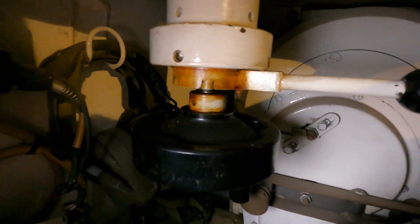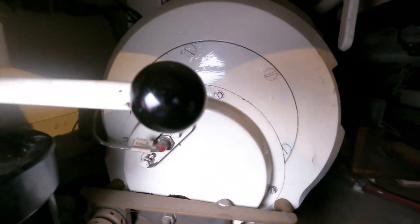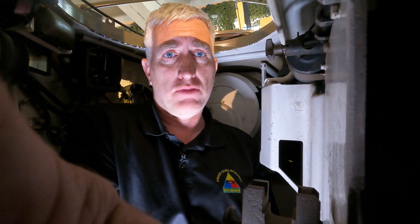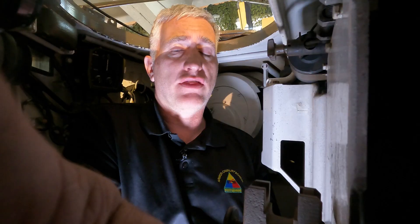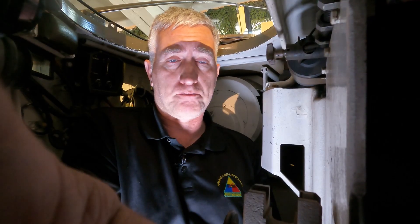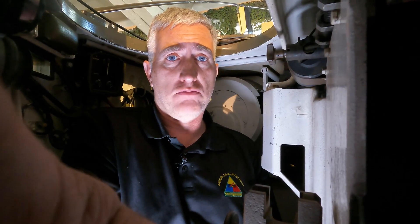The revolver over my shoulder is the same as the one on the commander's side, reversed. That leads to another problem with the stabilizer: because you're stabilizing an entire top turret, the thing needs to be well balanced. But you keep firing rounds out of the extreme far end of the bustle — it's the old force multiplied by distance thing. The weight of the 12 rounds of ammunition as you use them up starts unbalancing the turret, which is a problem for the analog stabilizer. The more you've shot, the less stable your stabilizer was stabilizing.